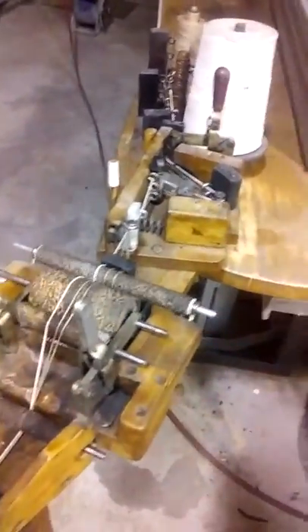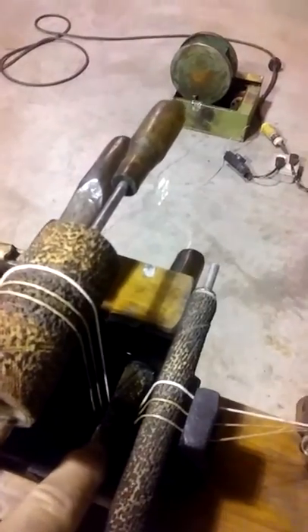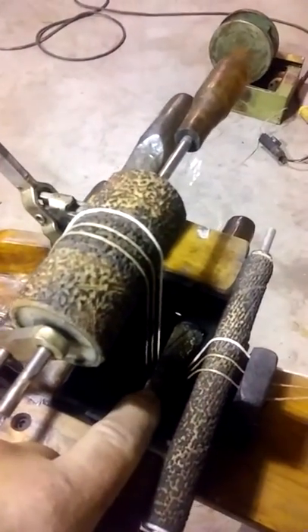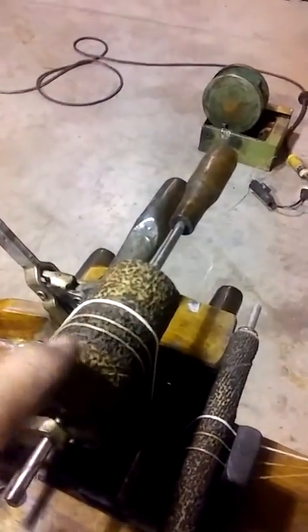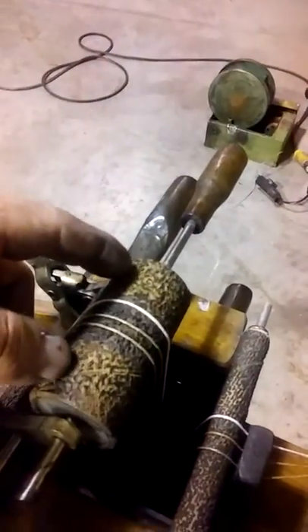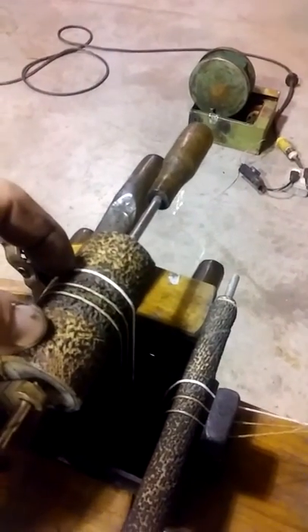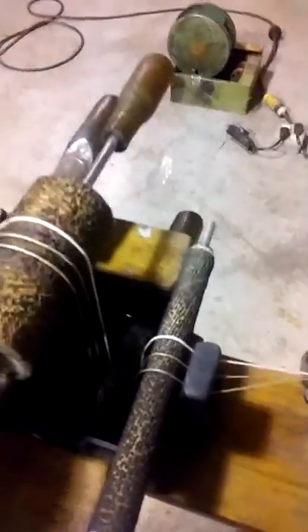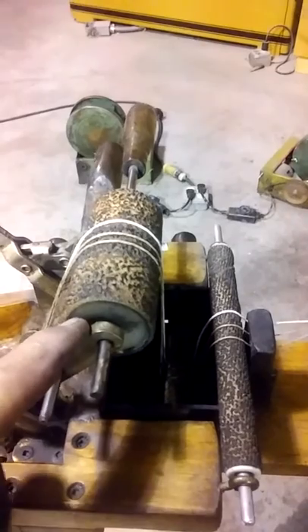That's just for the video only. What's going on here is this is the tub, and there's another roller down in here. These are just paint rollers you get at the paint store, and I just flame them with a propane torch — that kind of gives it a poor man's version of knurled aluminum. They're nice and hard and waterproof.